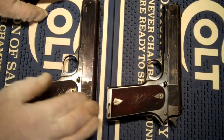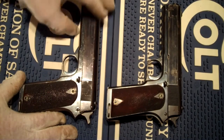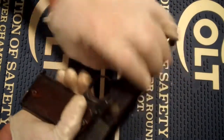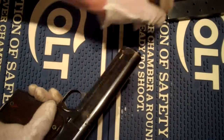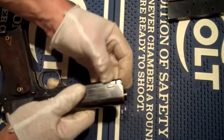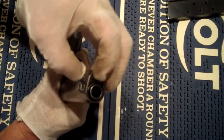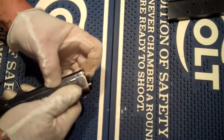That's a good comparison of the 1905 45 ACP to the 1909 45 ACP. Let's do a quick field strip of the 1909 here. Go ahead and remove the magazine, then cock the hammer back. Now that's the other thing too that was developed — this place to depress to hold the spring back so we could get the slide block out.